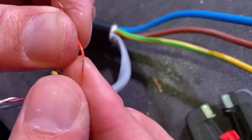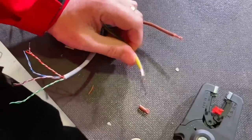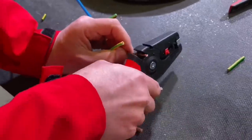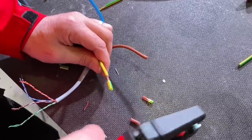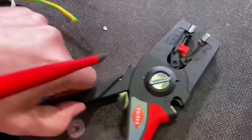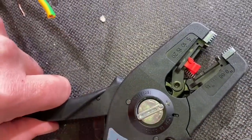We're going to have a crack at one of the cross-linked polyethylenes next — that's always the difficult one. We really struggle with tools that will strip this. So cut it back, chop the end off. We had a little go there — wow, that was easy! And if you do need to make adjustments, there's a dial on the side here where you can just trim it to adjust the blades.